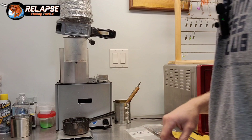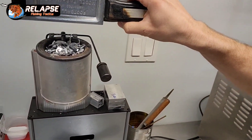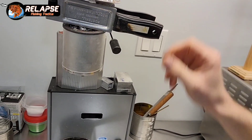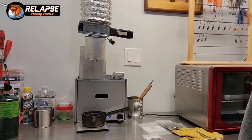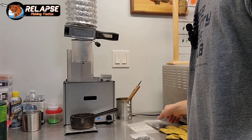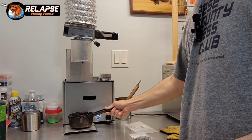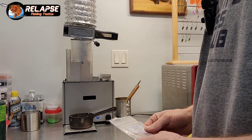This is still warming up, there's still a lot of stuff that hasn't melted yet. All of the stuff I've clipped off — the sprues and stuff — I just set back in there once it cools down. I don't like putting them in the lead pot when it's still hot because it can splash and it cools the lead down. I also don't clip them off right away; I let the lead set up all the way before I remove them.